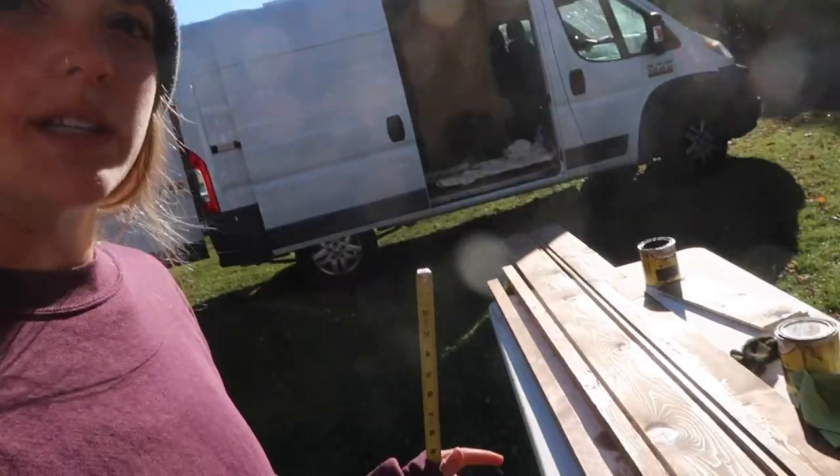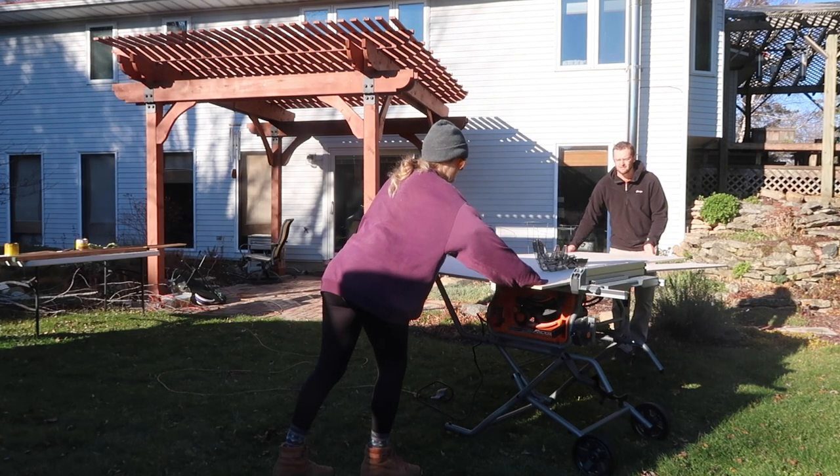Getting sunny now finally. Once I wait for some of my two-by-twos to be done drying, I'm going to cut what will be the very bottom of my cabinets. I'm figuring out exactly how wide I want them so I can prep the bottom of my cabinets for the puck lights, stain that, and then start working on the upright studs. I've decided I'm going to do 11 inches wide for kitchen cabinets and 13 inches wide for bedroom cabinets.